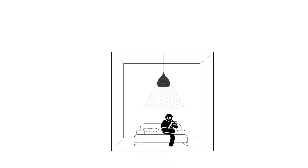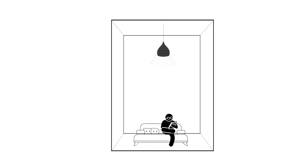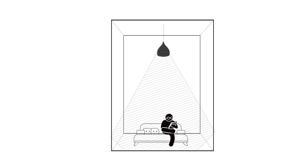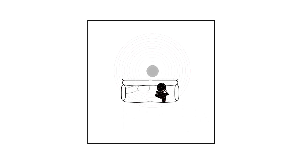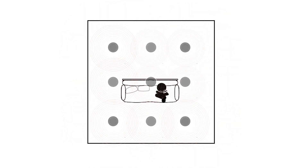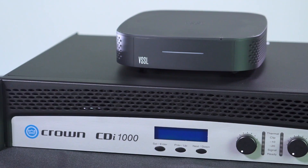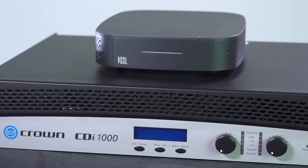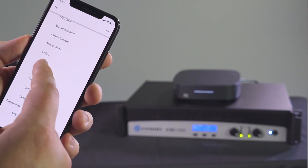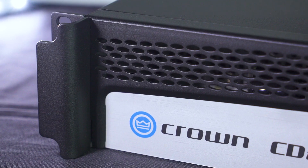The reason for the variation between these examples is predominantly two things. First, we leverage ceiling height to help sound dispersion — the higher the ceiling, the more uniform the sound travels throughout the project. Second is speaker saturation: the way to drive volume levels in commercial projects is to add more speakers. For zoning with the Vessel A1 and Crown, for each zone where you want independent volume control and different content playing, you will need a separate A1 and Crown amplifier.